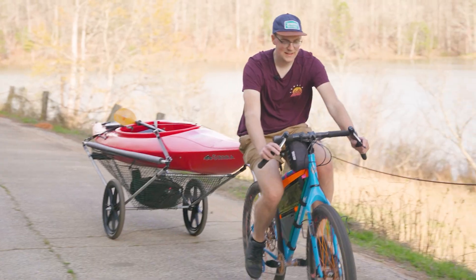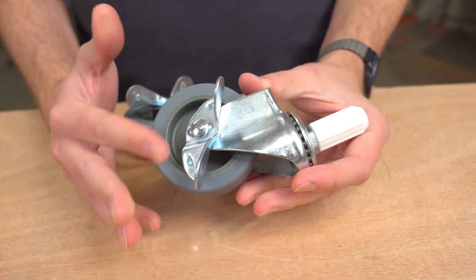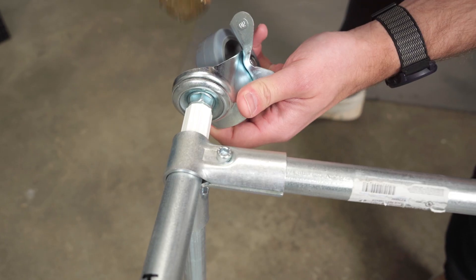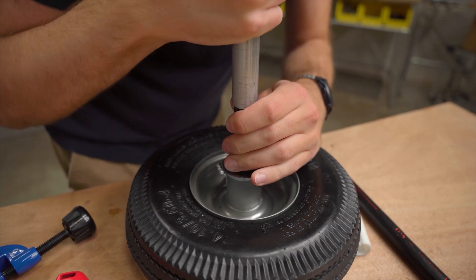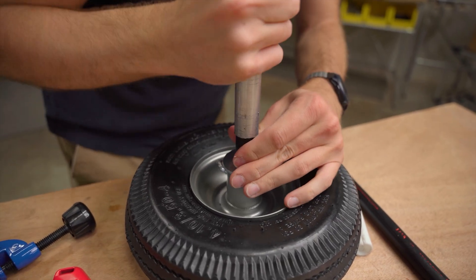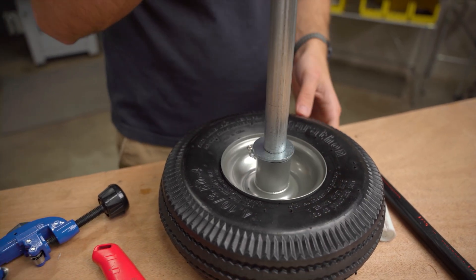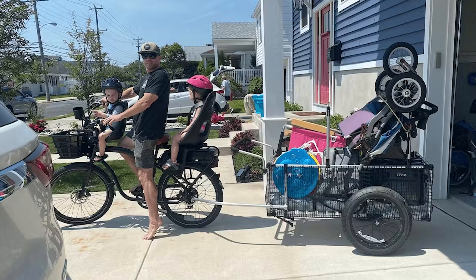Another common problem is adding mobility to your builds, and there are a couple of ways you can do that. One of the most common ways is to use casters — we have these on the website, we 3D print these, and they just insert into the end of the EMT conduit and secure in there nicely. You can also make a custom axle using threaded rod and pneumatic wheels. I have a full-length video linked below — it works really well for kayak carts and different things like that.